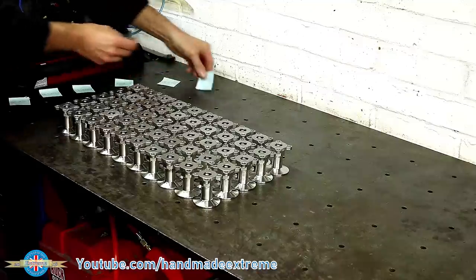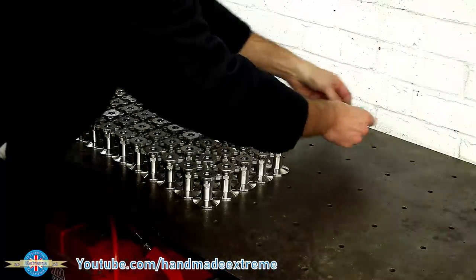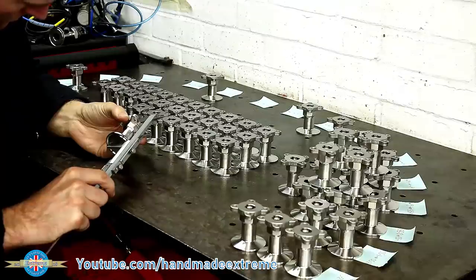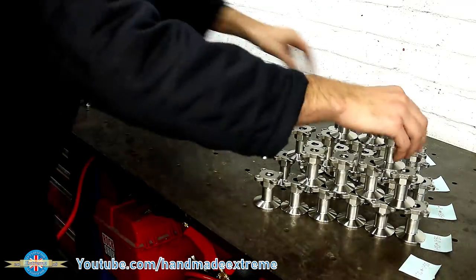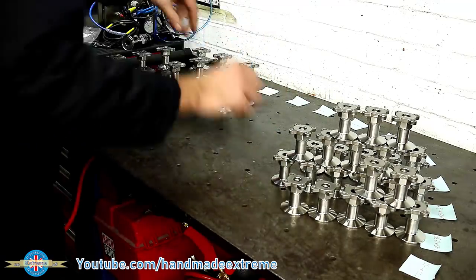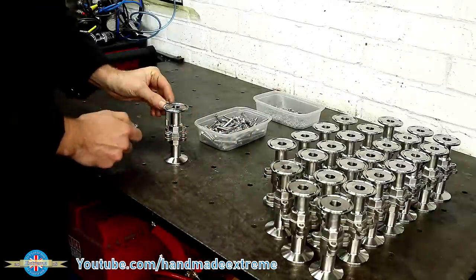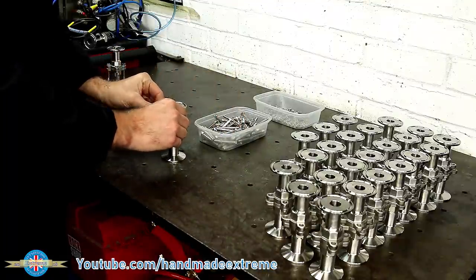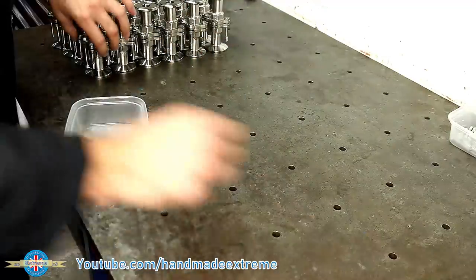The automatic valves are a little bit more complicated. The auto valves have an overall length tolerance once they're assembled, so what I'm doing is putting down post-its from left to right, minimum size to maximum size, in 0.1mm increments. I can then measure every part and group them according to their length. A pair of parts can then be selected, essentially taking the largest one and the smallest one and working your way inwards from the two extremes, so that the maximum number of parts are as close to the mean average nominal dimension as possible. This is basically a variation on the select-on-test method. I can then move on to putting three of the four bolts back in the holes — just doing the bolts at this stage, then I'll do the nuts afterwards. Doing one operation on all of the parts then doing the next operation on all of the parts just saves that little bit of time — it accumulates over the project, and by the end of the job you've saved a surprising amount of time.